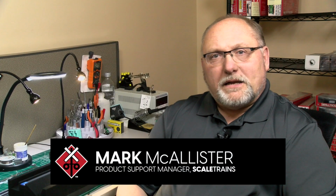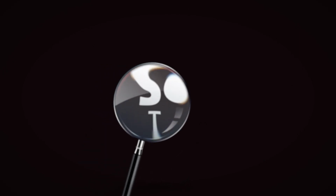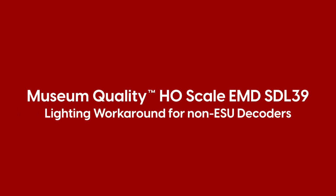And we're going to talk today about installing a jumper wire in the SDL39 so that non-ESU decoders may have access to the lighting features. So we've received feedback in regards to our new SDL39 and not being able to operate the lights when installing a non-ESU decoder. So we want to take a look at that today and why that is.